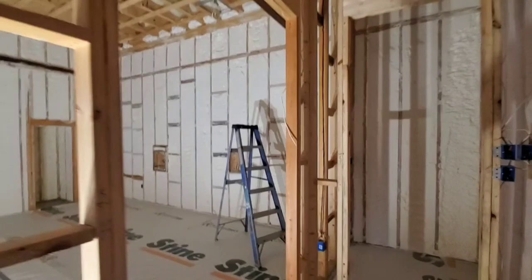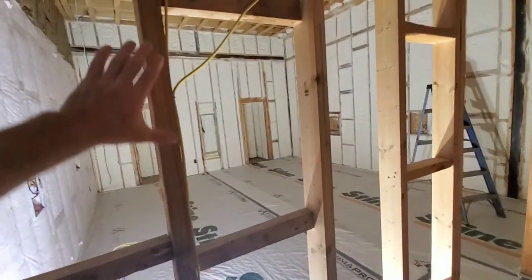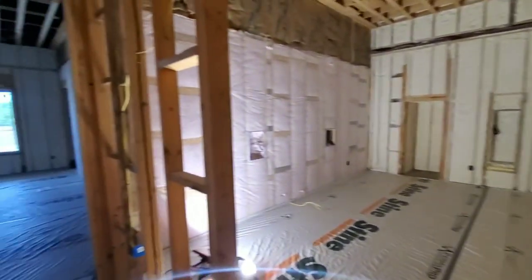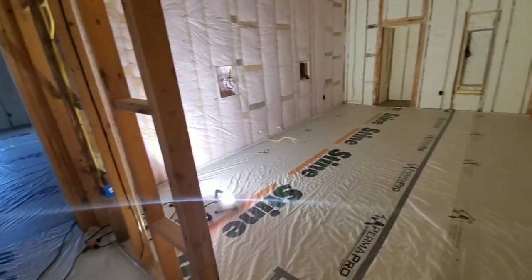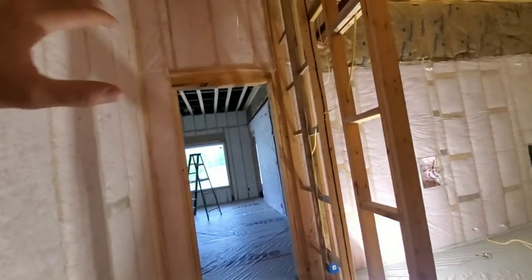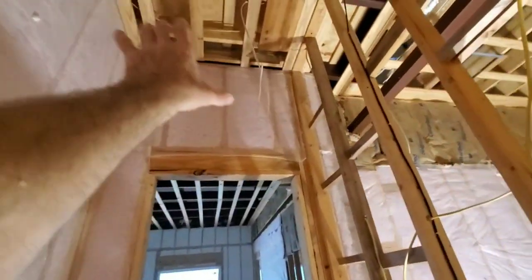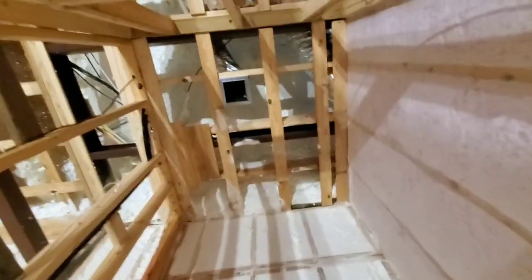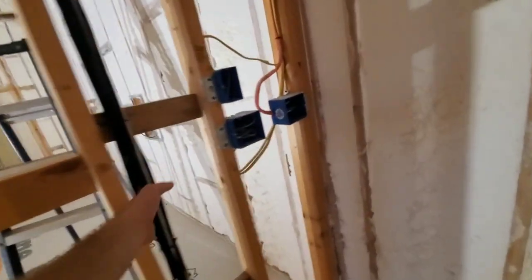This is a 12-foot ceiling right here — that's an 8-foot door just for scale. It's actually going to have a false ceiling in here at about eight and a half feet. The partition wall between the hall and the theater is not going to exist acoustically — acoustically the room goes from there to here. This is going to be a large and very effective bass trap, so we're going to have outstanding, quick, tight bass. Quick and tight bass is also a characteristic of getting rid of peaks. We're going to have bass trapping all up here, plus a speaker going up there. Over here the same thing is being done above the equipment room. Here's our bundle coming down — all of our speakers, 12-gauge to all the bed-layer speakers and 14-gauge for the Atmos.